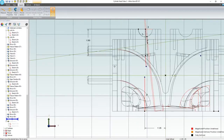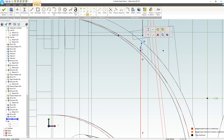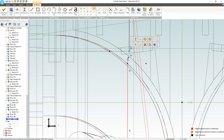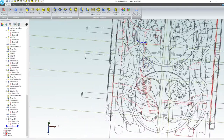I have to go back to my front view here to really see what's going on. So go on to the 2D sketch. I have to redo my arcs because they're really at a different concavity, and I bet that's what the previous error was all about. So, tangent. It's always faster to redo stuff in CAD. Have you noticed that? I guess because you already have worked through the design intent mentally. And we already have that constraint. So now let's go with an equal from here to here. Maybe I can be a little bit bold and try doing a 4-inch radius on these. Wow. Yeah, let's do something like 24 inches, and we still have plenty of room, and that still looks good. So let's deactivate the sketch. Good. So we have a pretty straight shot that'll help flow out as well.